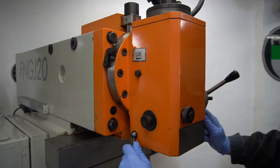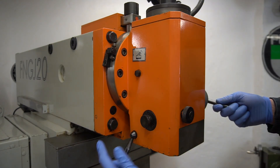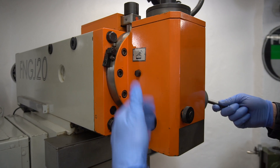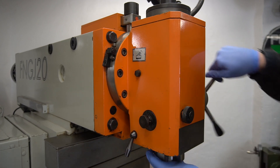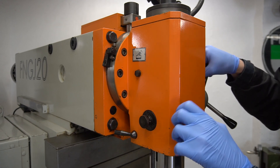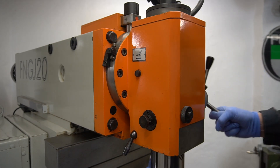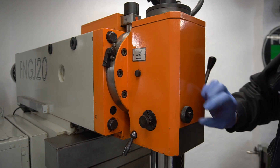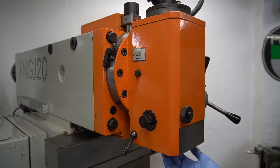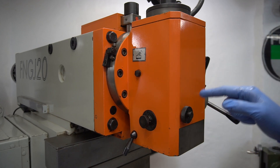So let's change back to the ISO 40 normal quill. What we're going to do is loosen the quill lock, remove the quill key or quill guide, extend the quill all the way. Just need to lock this and tighten this a little bit so there's a little bit of tension in the quill. Because the quill is now out of the head, the only thing holding the quill handle is this lock.